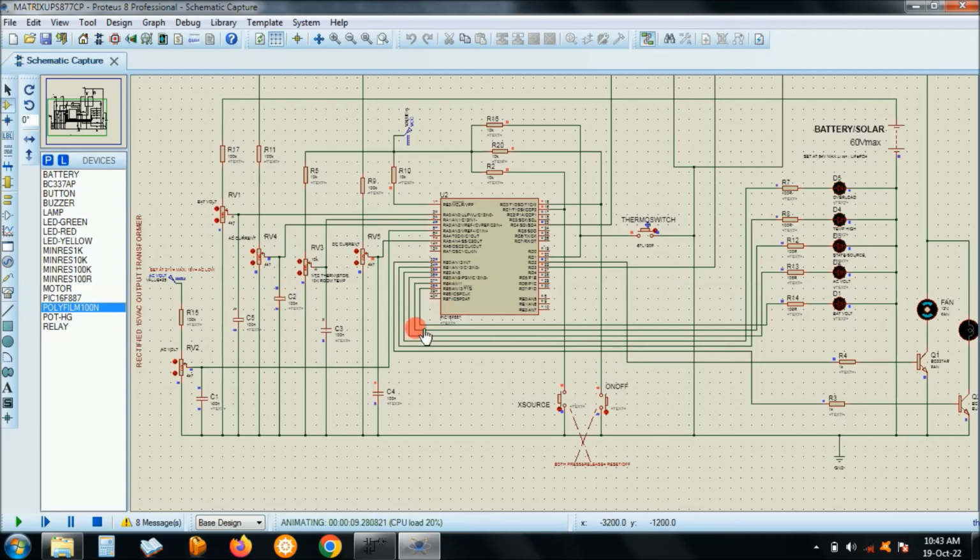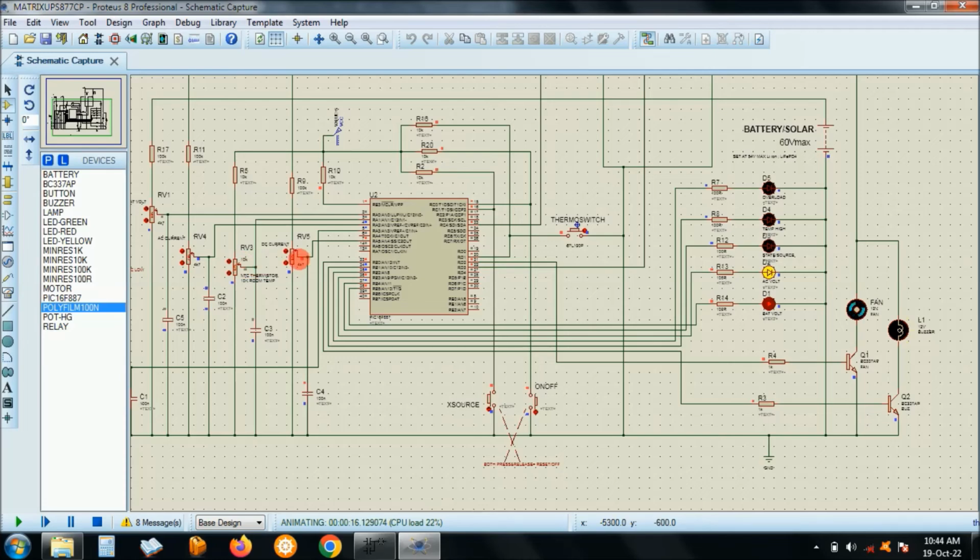If there is any problem, like the temperature has gone high, right, the fan will start. Okay, even if the temperature normalizes, it will continue running for a minute. Okay, but if you have DC current too high, first it will pass through a point where it actually just warns you of an overcurrent. Okay, I think this is overcurrent mode, and then later on it actually switches off. This is now a fault condition. Okay, and it shows you this LED here, that's overcurrent.